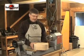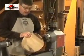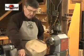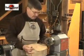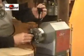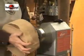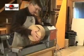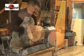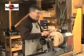Talk is cheap — but does it really turn wood? Let's take a look at how it does on a good big heavy piece of green maple that we just bandsawed out of a log. We laid it out with a set of trammels, which gives us the exact center, drilled a pilot hole for our worm screw, and we mount the worm screw in our tightened chuck. We slip it behind the jaws, get onto the flats, lock it tight, put the blank over the screw, turn it with the hand wheel, lock the spindle, slide the tailstock up with a live center, and lock it against there — we now have it pinned safely.